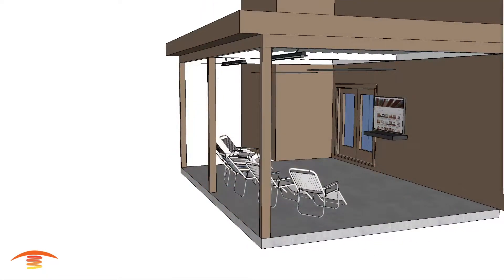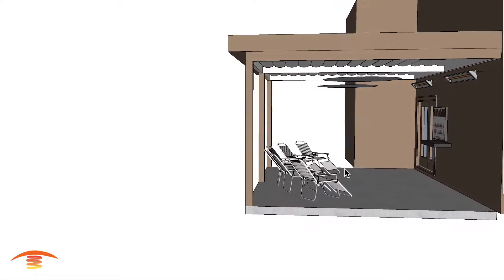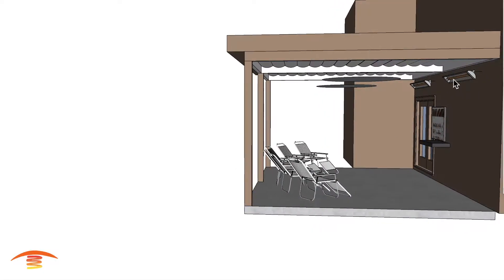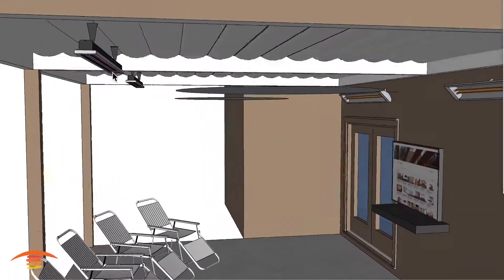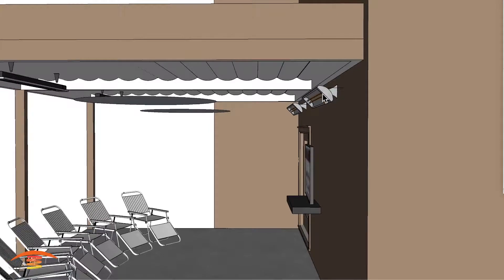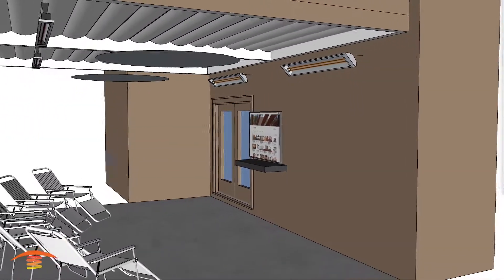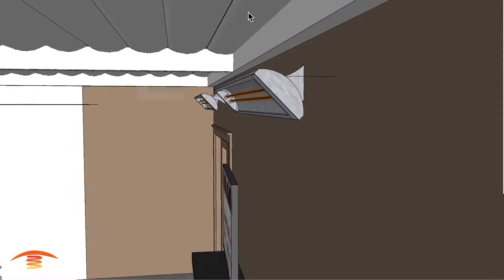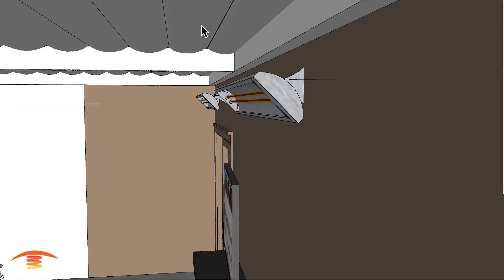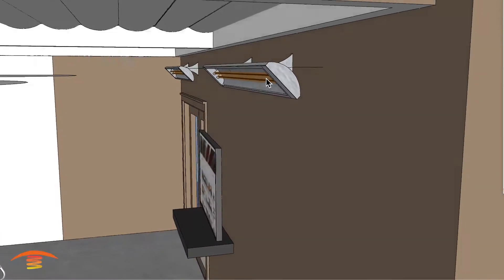Let's look at a different option — placing some units on the wall over here. In order to get enough heat you'd have to go with the highest output heater. These would be the CD6024, so 6,000 watt, 240 volts. This dimension here is approximately five inches where this height from edge to edge is approximately eight inches, and these do have two 3,000 watt elements. Using the clearance to combustibles — being that this aluminum top is just underneath a wooden structure — I'm leaving this at 12 inches of clearance when mounted on a vertical wall.